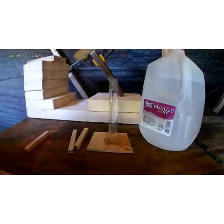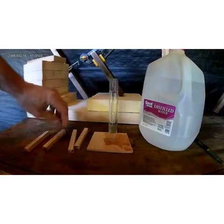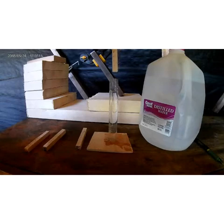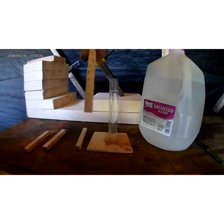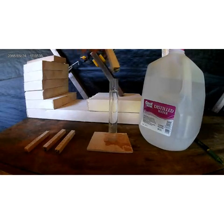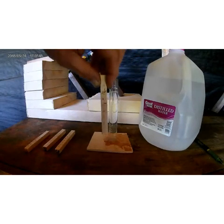Ash has a quite high specific gravity. The select ash should be 0.56 minimum and this one came in at 0.68. The common white ash from Wooden Aviation came in right at average, 0.62. The Pennsylvania ash is also select, about 14 growth rings per inch, and came in at 0.72. I've already marked the samples from a few days ago and they retested exactly the same after drying.